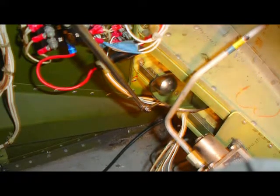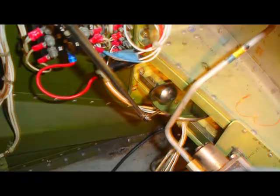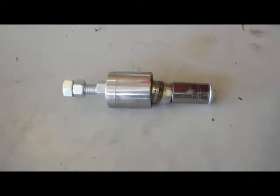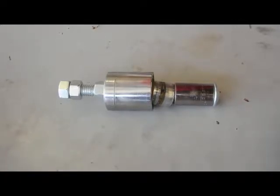Here's the other side of the bulkhead below the avionics bay. This is the ideal time to inspect for cracks in the hat sections and surrounding structure. The removed bushing is in the center with puller sockets on both sides.